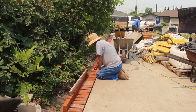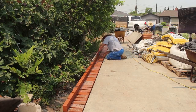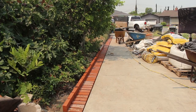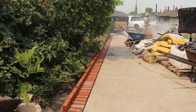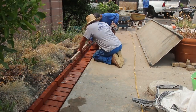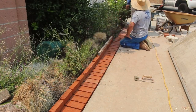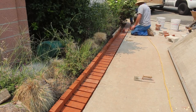If you have bricks going one direction off the drive and another running the long way, each brick will cover so that if you're setting them correctly, two bricks one direction and one brick the other direction should still line up on your joints. If they don't line up, you didn't set them right. You can see it better here — two bricks, a joint, a joint, then the other standing bricks lined up with them. Unless you're intentionally offsetting them, then you'd want to be exactly split center.